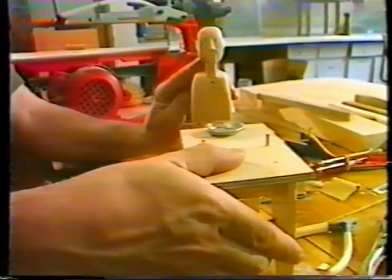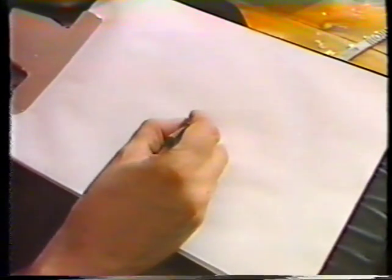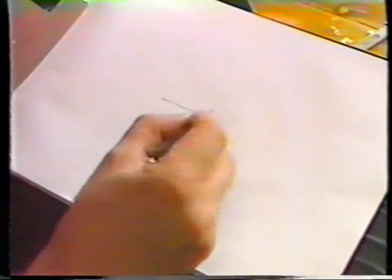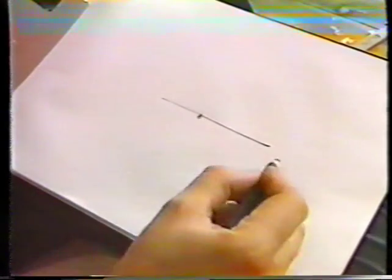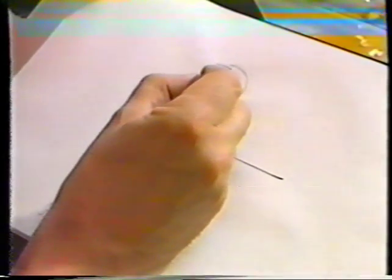What we do next is make a table and have a bowl for the food to go in. The food we're going to use is spaghetti, because spaghetti tends to follow the path of the spoon or fork delivering it. That means if we make rigid spaghetti, we don't have to worry about all the muscular movements of the arm — the spaghetti will push the arm into place. All we have to do is find a way of manipulating the spaghetti from underneath so it forces the arm and fork towards the mouth, and that requires a bit of geometry drawing. We start with a fixed point on the table — the hole in the plate through which the spaghetti travels — the spaghetti has to come up and then around the jaw.